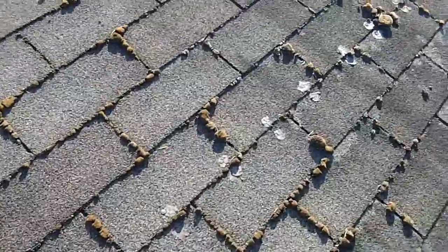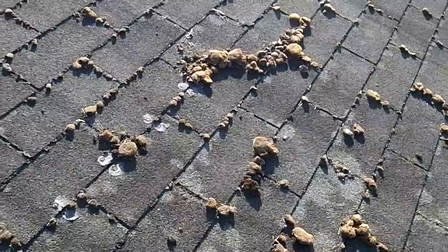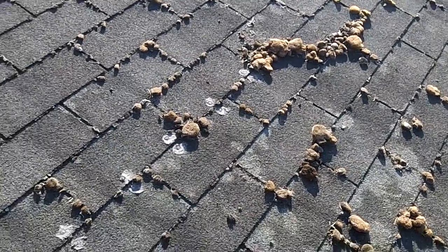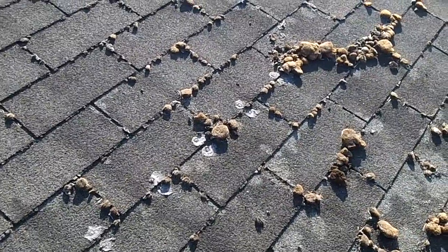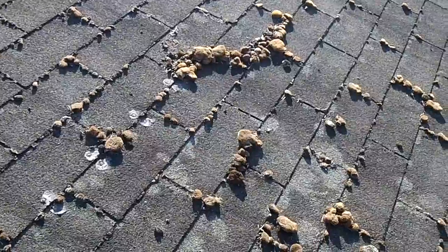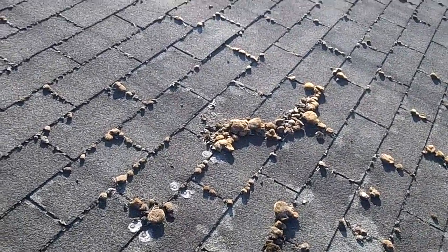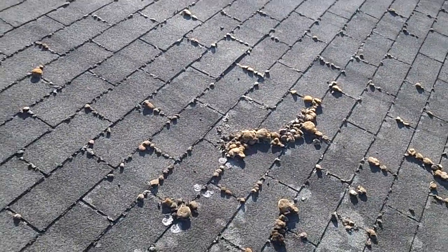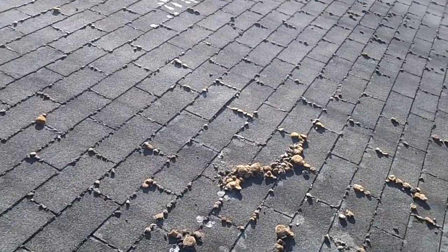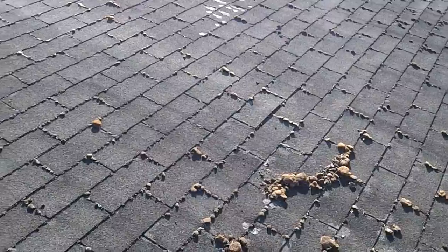Along this ridge. And right here, I got a leak. So I'm pretty sure that it's probably due to these exposed nails with this old dried up roofing tar. So when I tear up the shingles here, I'm gonna have to replace the plywood sheeting underneath, because it definitely has some water damage. Hopefully that's the only spot. That's the only spot I could see from inside the attic.